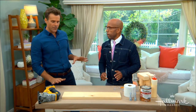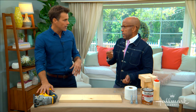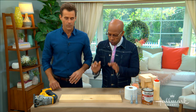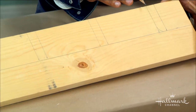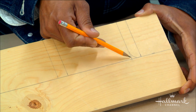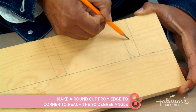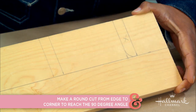Cutting out these little notches can be a little bit tricky. We're going to use a jigsaw today. If you don't have one, you can always rent one or cut it by hand. The technique: first, cut straight down all the way to your stop line. Second cut, same thing straight down to the stop line, then back up and cut along the curve. That piece drops out, and then you go back and cut the last bit — three cuts total and the notch comes out.